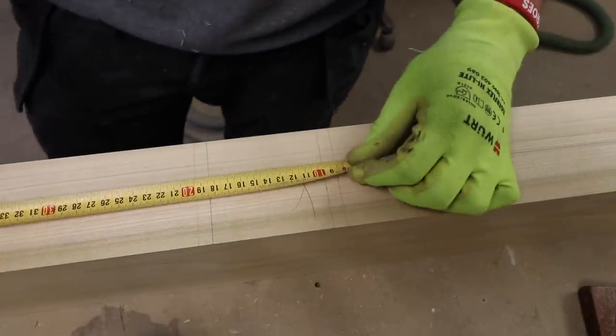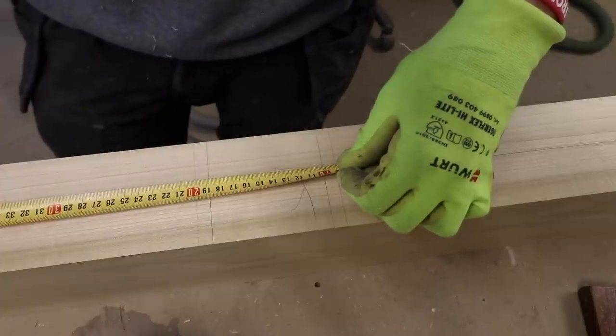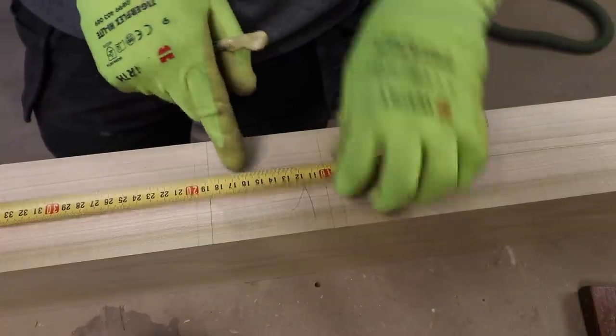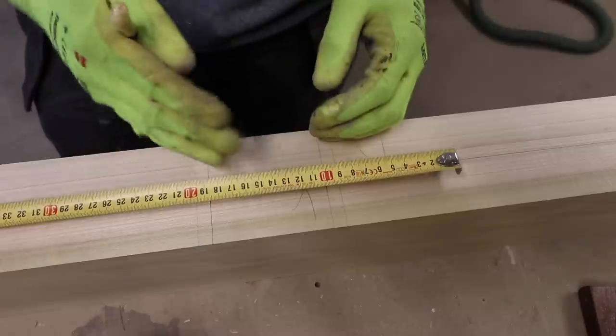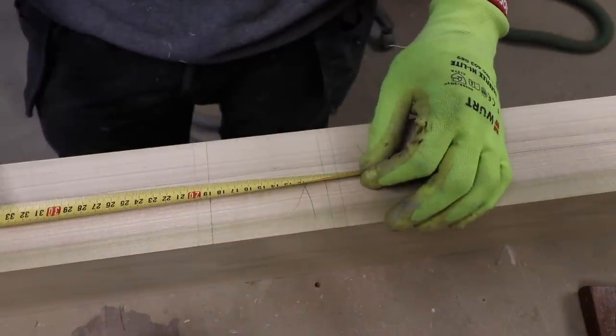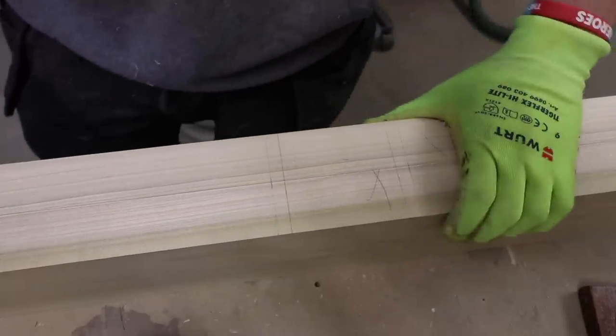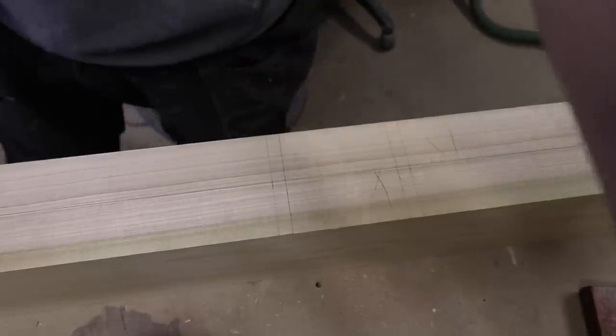And being 88mm, that is quite a lot. It's a tiny bit more than ideally you'd like on a single tenon, because the tenon can have a tendency to crush too much and not make too tight of a joint. But I think it's acceptable for this particular application in the middle of a door. It's going to be fine.